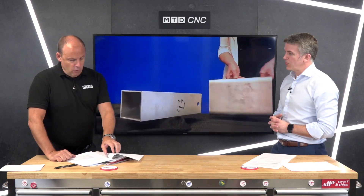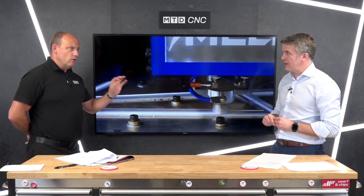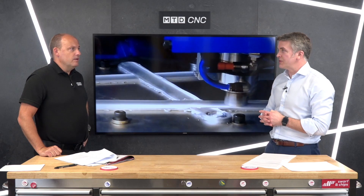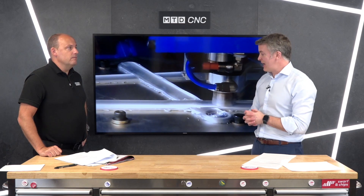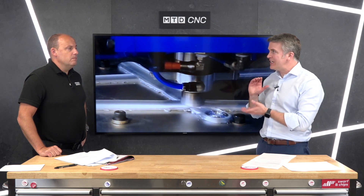For you at Ram Engineering, Ross, who are you going to be talking to about this? So far there's a lot of aerospace interest, obviously with the aluminium side of things. When we're talking about titanium now as well, titanium lends itself to aerospace but also biomedical applications — it's titanium 64. These are critical industries; the integrity of the product has to be absolutely spot on. There's no other material used, nothing contaminating, and because it's before the melt process, nothing's slipping away — you're getting a fully dense substrate.